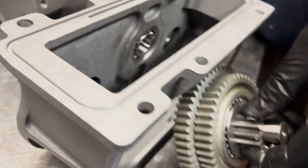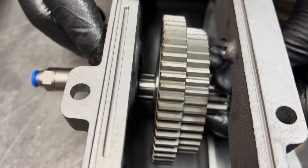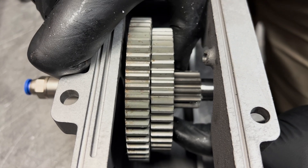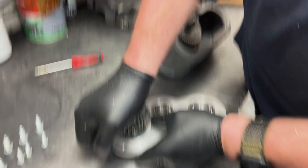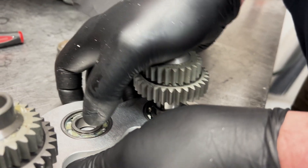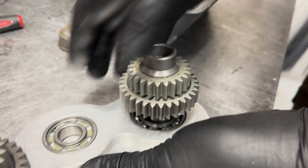Locate the central gear cluster into the bearing bore hole where you installed the air piston. Once located correctly, you should have a similar gap between the gears and the wall of the top housing as shown here. Locate the first pinion gear into one of the outer ball bearings on the top housing cover plate, then repeat this with the second pinion gear on the other side. Your cover plate should now look like this, ready to go into the top housing.